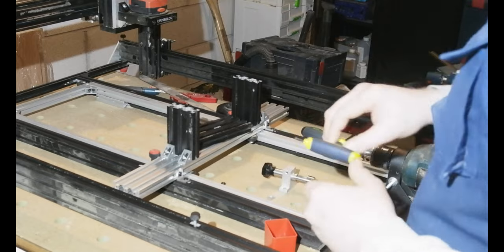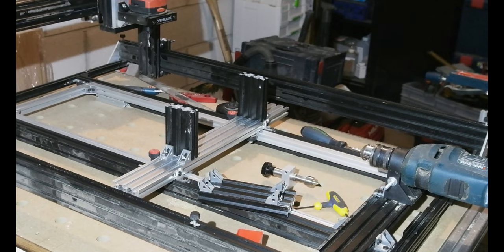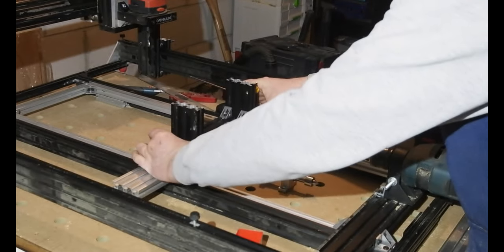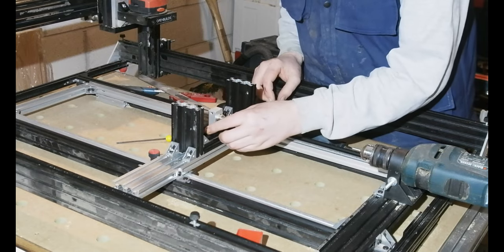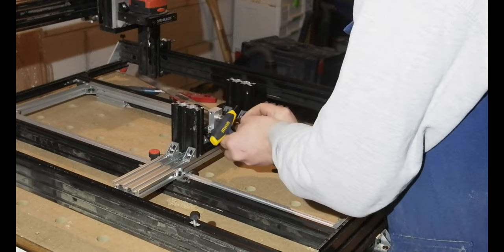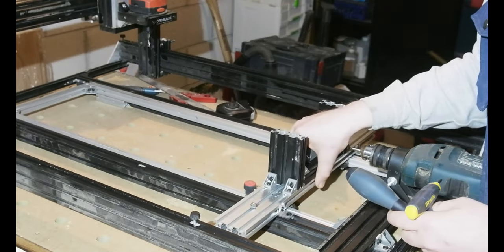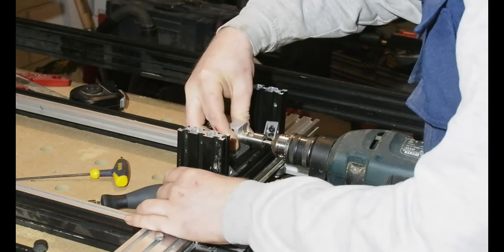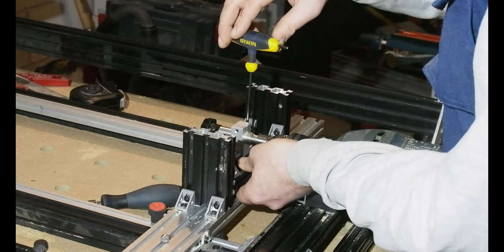I have two thumb screws with sliding T-nuts in the back of the tailstock platform which run in the lathe frame rails, allowing me to lock and unlock. The two L-brackets at the front are essentially rests to add extra support on the main base frame, but can also be locked to keep things extra rigid. On the benchtop you can see the mini tailstock and the pieces I've got together to make a fully adjustable mount for it - two legs and a platform. I fix one leg square, leaving the other loose, then slide in the platform for the tailstock, then fix the other leg. I can then bolt on the mini tailstock. To set the tailstock in line with the drill chuck, I remove the little point centre - these aren't morse tapered, just a straight 6mm shank. In the drill chuck I have a crown centre reversed so the shank can be slid into the tailstock, holding it in position so I can fix everything. That's it - built and ready to turn.